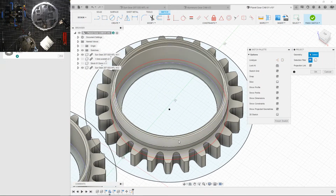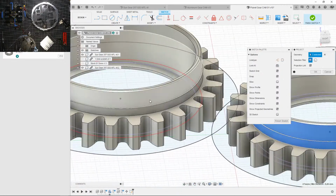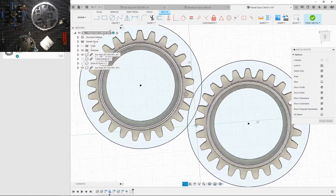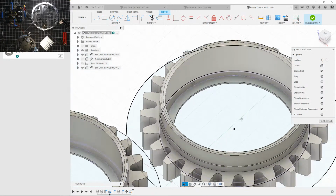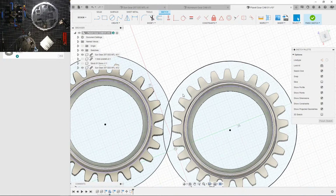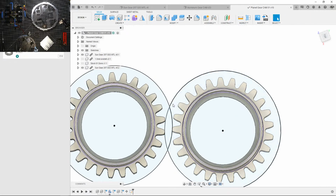I should project these parts as well. I was thinking I could probably go in there with a 1/4 inch, but if I do, I'd have to do contours into it. But I think it'll be fine. It'll be quicker than just hacking all of this out with a smaller end mill. So I'll be doing that.